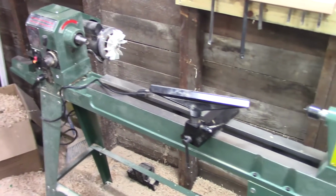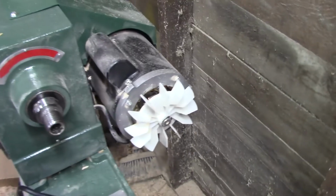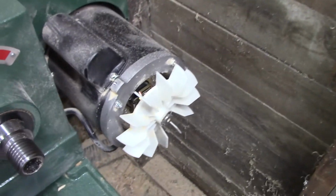After doing a little research afterwards, I found that the Harbor Freight Lathe is actually very underpowered. I'm not upset though. When you buy Harbor Freight, you take these chances. So I just happened to burn out my motor on something that should have been super easy. But as I said, once I started reading more about it and seeing different reviews, I see that the motor is pretty underpowered. It rates at 3/4 horsepower on the box, but most people are of the consensus that it's about 1/3 horsepower, which is not nearly enough for anything more than small pieces of wood. Anything more than 2 pounds will bog it down, apparently.